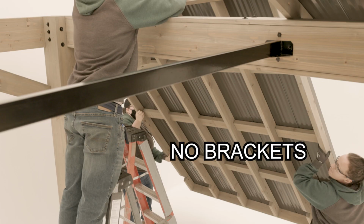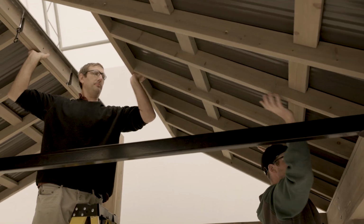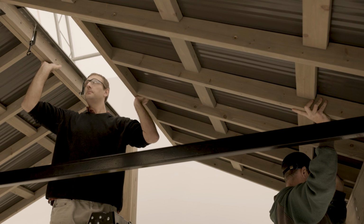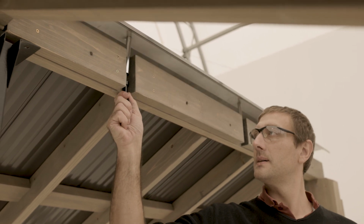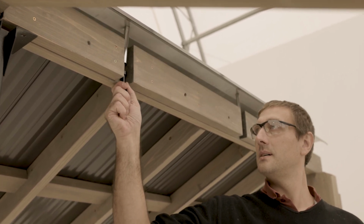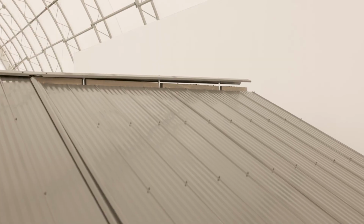Now is the time to bring in the final roof panel. We recommend having an extra ladder in the center, as additional help may be needed to get the panel properly in place. Make sure the panel is in the correct position. 1 person on the center ladder will need to push up on the peak cap so the roof panel can slide underneath, while the second person guides the panel into position.